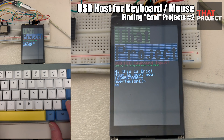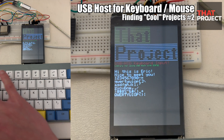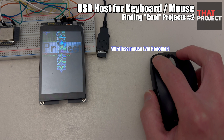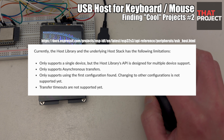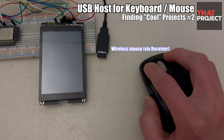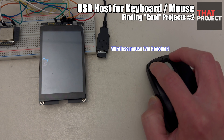It's really good. If we have an IDF environment configured, there is no need to use this, because internally it is the same — the related APIs are adapted for easy use in the Arduino environment. The last limitation is that ESP32 does not yet allow two devices to be connected at the same time via USB host. This part needs official support, and if you need more than two USB connections at the same time, I recommend using a different microcontroller.